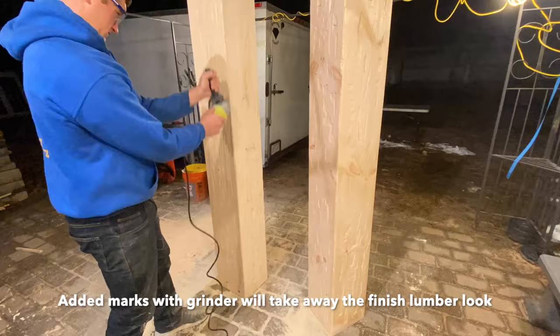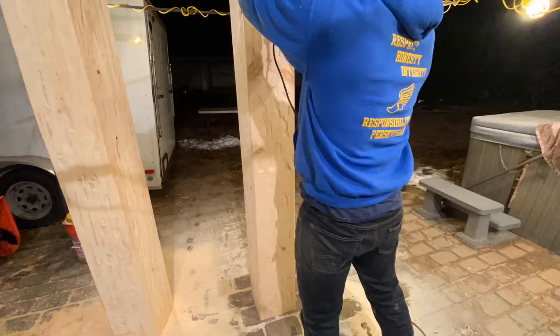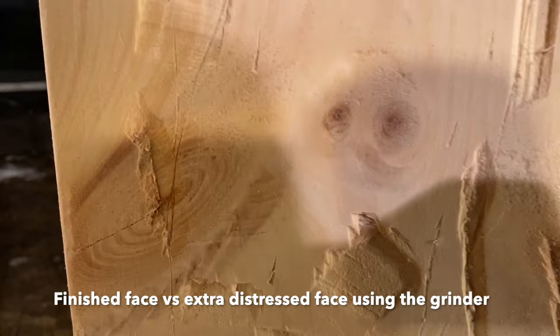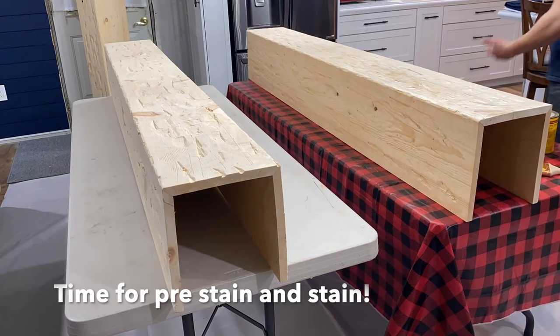There was still a lot of finished surface left over, and there was no way I was going to spend all the time gouging everything out by hand. So I took a grinder with a metal spin wheel on it and ground down the whole entire surface area of both beams, putting nice scratches in them to resemble a log a little bit better. When finished, it should have little tiny scratches so you don't get the nice finished lumber look — because when you stain it, those scratches will really pop out.